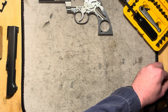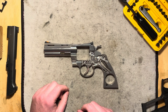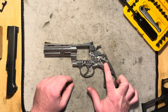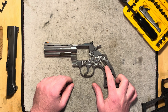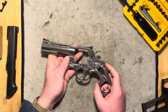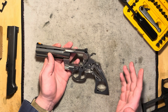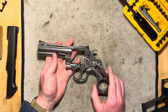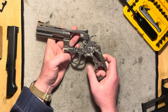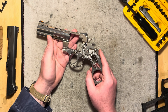But if you look back before the days of the auto loading pistols, the semi-autos, you have revolvers. So we've got the Colt Python here with the side plate off and cylinder out of it. This V spring here is the mainspring in the revolver. Now different revolvers are set up a little bit differently — Smith and Wessons, if you go to a K-frame, it's kind of a single leaf type spring; J-frames have a coil spring. But this is your mainspring.